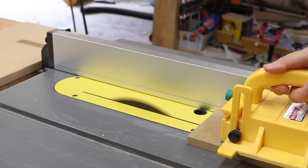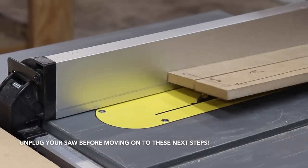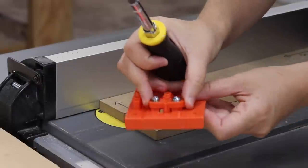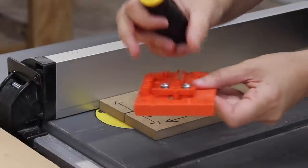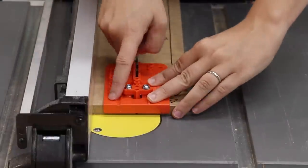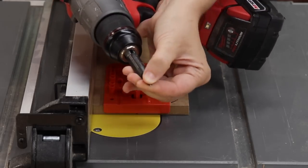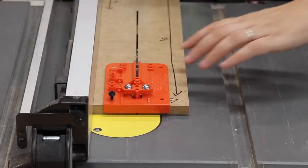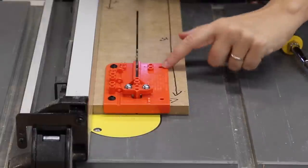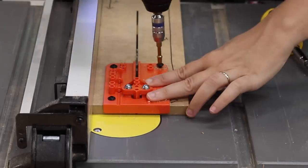Make sure to turn off the saw and wait till the blade stops moving, then remove the setup boards. The rear drill guide base has a piece called the rear drill guide, and you want that to be a little bit loose so that it moves from side to side. To make sure you are attaching the drilling guide block in the correct location, there are two tabs that you have to put pressure on towards the fence. I used a Vix bit to pre-drill all the holes to make sure they were perfectly centered, then locked them down with screws — starting with one side, then finishing off the second side while maintaining pressure towards the fence.